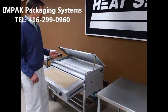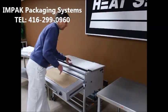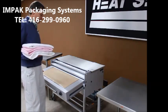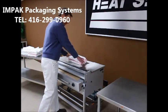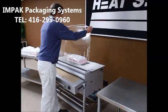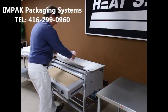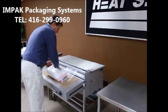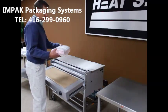Now I'll show you the basic principles for wrapping a package. Once the film is loaded, it's simply a matter of closing the cover down and grabbing your product to be loaded. You'll notice the hot plate is built on a roller, so as I step forward to place the product on the wrapping bridge, it slides in. It's a matter of simply pulling the film out around and underneath the package, then pulling straight back — the table will roll out — drop it straight down, pull each side of the film out, wrap it under, and you have a finished pack.